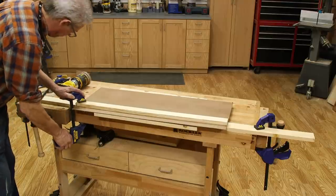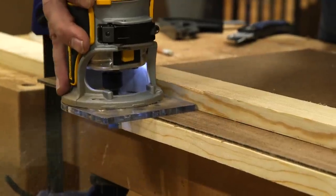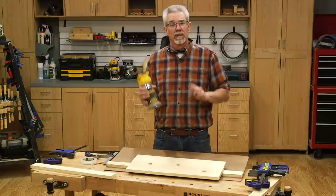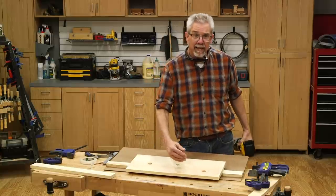In addition to helping me plow a groove, this jig will help me clean up the edge of the shelf. Just clamp it in place and slowly make the cut. To keep the shelf from moving around, I use double-sided tape.